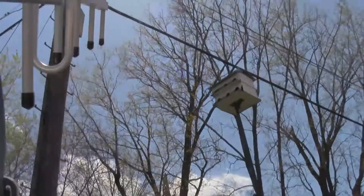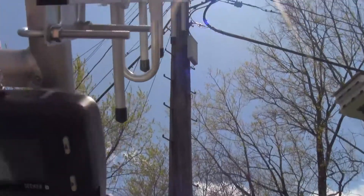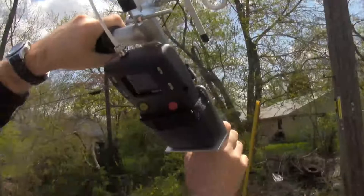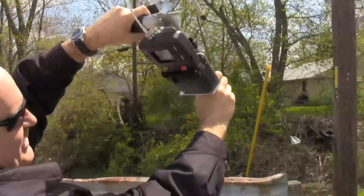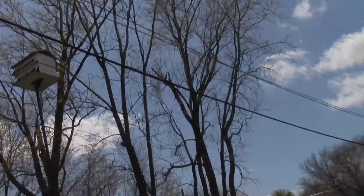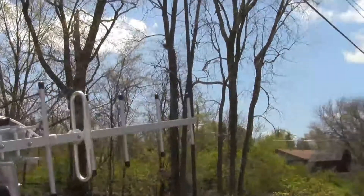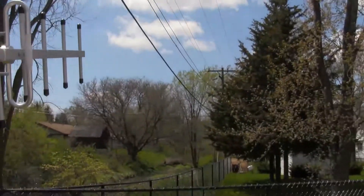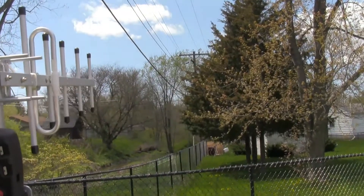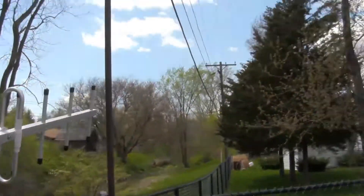We just found a null. I'm seeing 50-60 microvolts coming and going because of the wind — it's potentially a null here, and possibly it's traveling down the line. If I get down here a little bit closer and aim the Yagi down the line closer to those amps, you can see the level rises. We'll follow down a little bit farther.